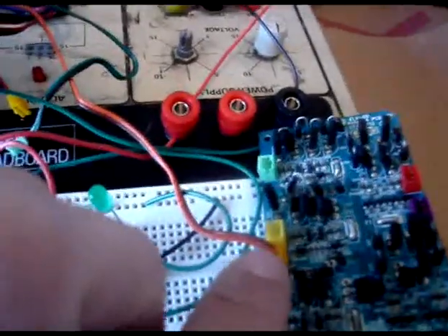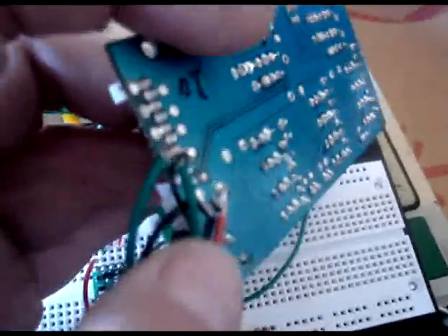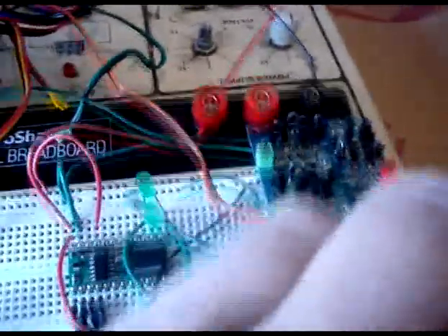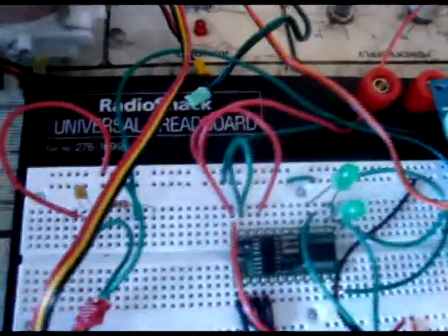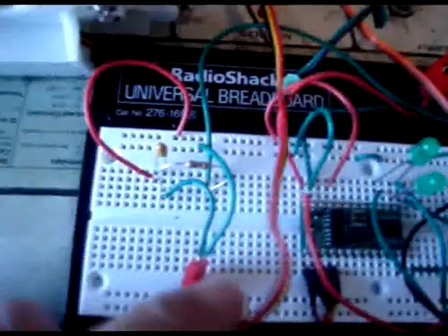This is the connector for the right and left motor, and up underneath here is where I soldered in for the 9-volt power supply and also the signal lines for turning the motor forward and backwards, which is giving a right and left motion. The LEDs signify that the motors are indeed turning one direction or the other.